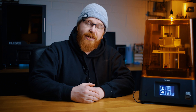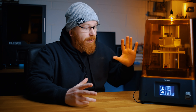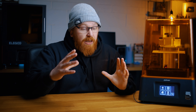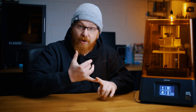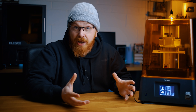If you're new to 3D printing, it's pretty terrifying. 3D printing companies are knocking out printers so fast it's really hard to keep track of. I don't like doing reviews because of the technology advancements — if you can call them advancements, it's just a spec race. It's quite frustrating when you're looking for printers because everybody says you need 4K, you need this, you need that. What I've found with all the printers I've tested over the last few years — you can check my older videos — it's not really about the specs. Some printers with lower specs will print a better model than a printer with higher specs. It's about the quality of light and the whole package: the resin, the build quality of the machine. This is why I'm not a fan of a cheap 4K printer — I'd rather have a more expensive 2K printer than a cheap 4K printer.